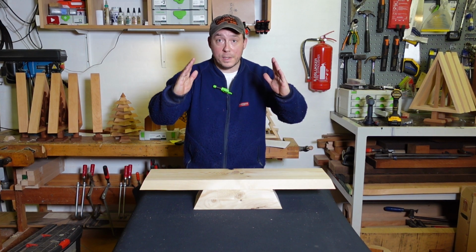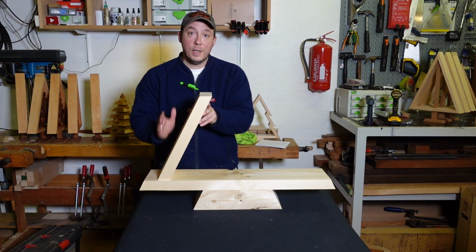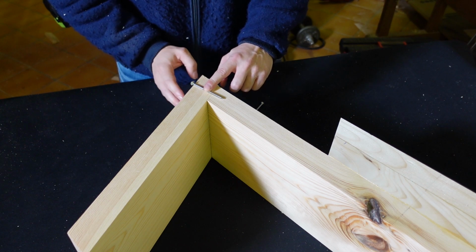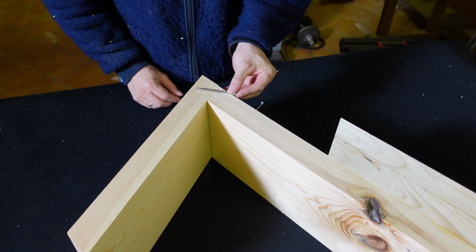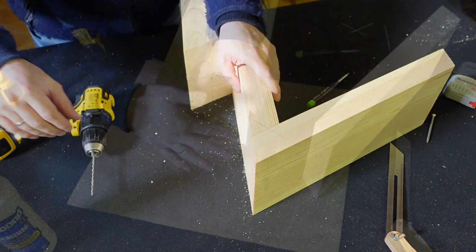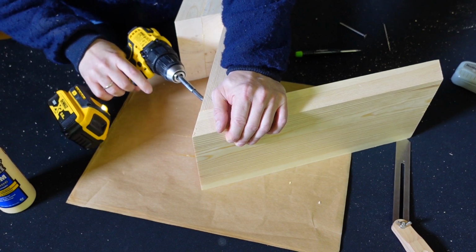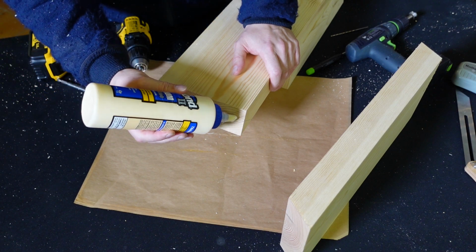Let's start building upwards. And all the sides are cut on a parallel way like this. Also called a parallelogram, you dummy. 25 degrees, all cuts. I could put the screws in like this, but I don't really want screws to be visible from this side, and I don't want to screw into end grain. So I'll put them in from underneath, something like this. There we go, and we'll repeat the process on the other side.